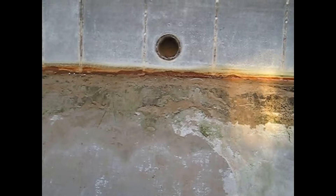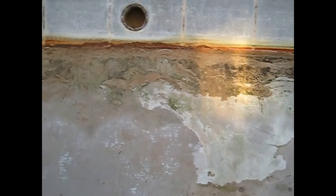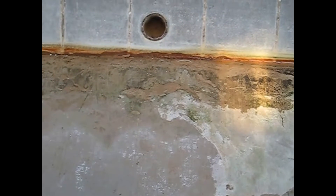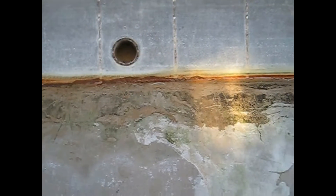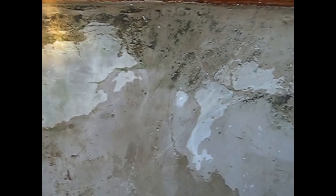We just pulled the liner out of this pool and incidentally there has been some leaks — like that light was leaking — and it saturates the areas around the pool. Once the liner is pulled out and all that water pressure is taken off, the groundwater is allowed to drain back into the pool.